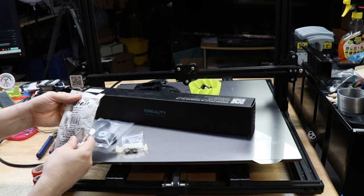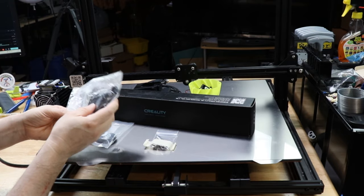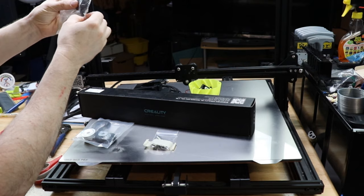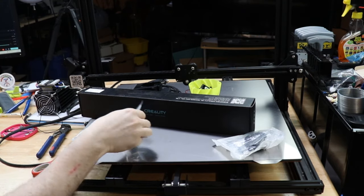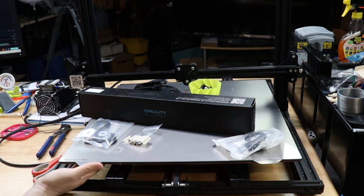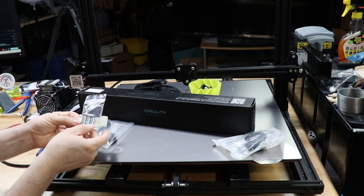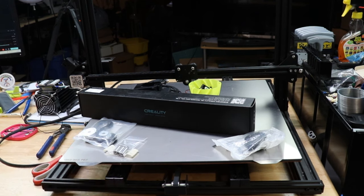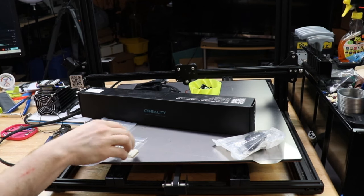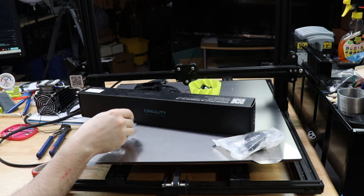This right here is just a cable reel, but I found these things are wonderful for having on top of the 3D printer — you loop it down to the wiring harness to keep things out of the way. With a printer this big, dealing with all the springs is not a whole lot of fun, and several people recommended going with solid spacers. So currently in there are some little springs — those will be coming out and these solid spacers will be taking their place.